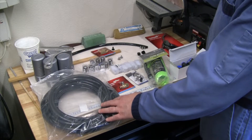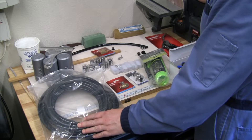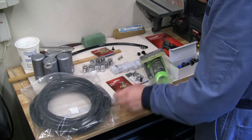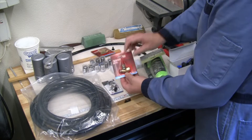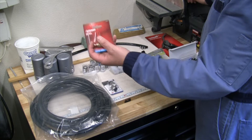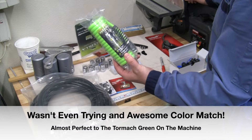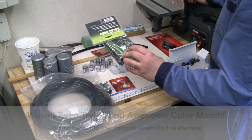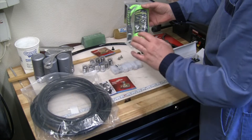Here's the parts list I put together for this project. We've got some half-inch pneumatic line to run out of the T joint I already have — it'll come up around the corner and should match the coolant line that came with the machine. We'll end that with a compression fitting, transition to quarter-inch threads, and put in a ball valve so I can shut off the wash-down hose while running coolant without just trusting the nozzle. Then we'll go into some flexible quarter-inch airline — this is half-inch OD, quarter-inch ID, so probably a little smaller, but hopefully enough volume.